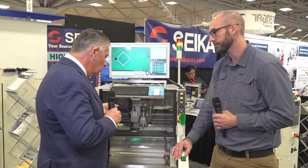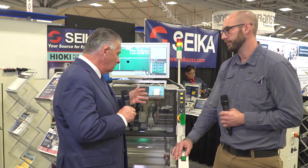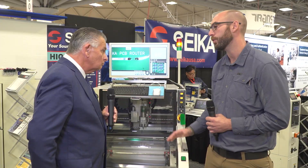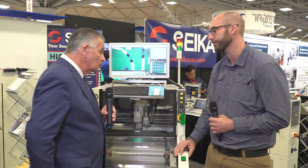So tell us, what are the key benefits of using this machine — the Sayaka CT-34 XJ? Some of the main benefits are: easy ability to work with a cobot; the sliding forward table makes it a lot easier for operators to load and unload; the integrated camera, which allows you to teach it right online, makes it very simple with point-and-click operation. It's extremely repeatable, extremely quick, and there's very little dust — it's all pulled out through dust collection from the fixture from below.